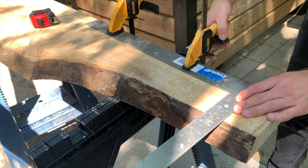After around 20 minutes or so we got both tables milled down to a uniform thickness. Next I cut about a quarter to a half inch off each side to remove any impurities or areas where epoxy seeped out — using a circular saw and straight edge as a track. I repeated that for all four sides of the first table, and did the same for the second table which needed it even more because so much melamine had stuck to the sides. I tried to cut off the minimum amount possible to maximize the overall size of the coffee table. A table saw would be a better option, giving a faster and more uniform result.